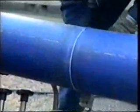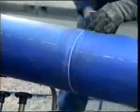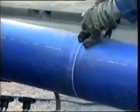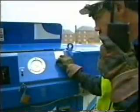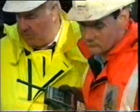The process recommenced after the conclusion of the cooling period and satisfactory checks on the weld beads. The winch operating load is preset to ensure that the recommended towing force and speed are not exceeded. The load recorder monitors the winch performance.